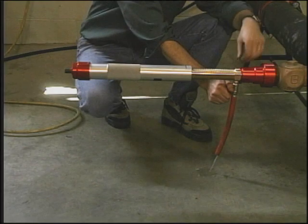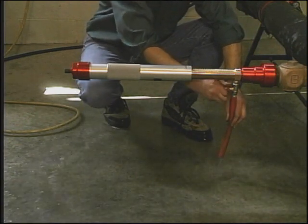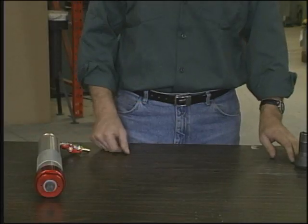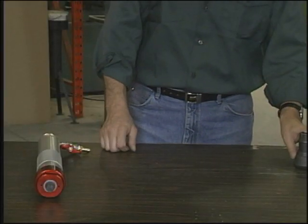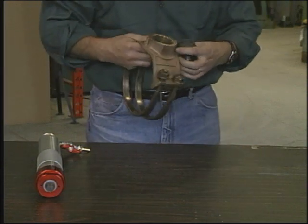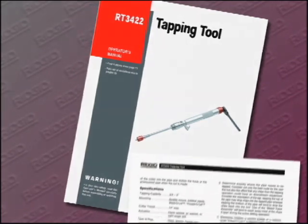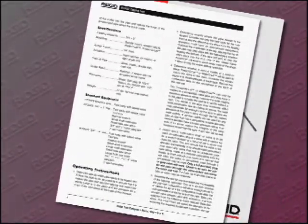Use of the bleed valve assembly will tend to wash away most of the chips if opened during the entire drilling operation. Determine whether a service saddle or a Weld-in-Place ThreadOlet or WeldOlet will be used to mount the valve to the main. Consider the advantages and disadvantages of each type. See page 4 of your operator's manual for further information.